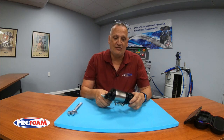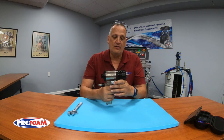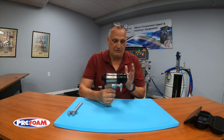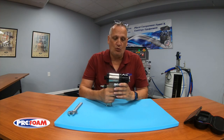I just wanted to go over something that can happen with your Fusion AP gun or Fusion PC gun: the mix chamber may start sliding back slower when you pull the trigger. It should snap back really pretty quick, back and forth when you pull and release the trigger. But over time it can get slower or even stop.